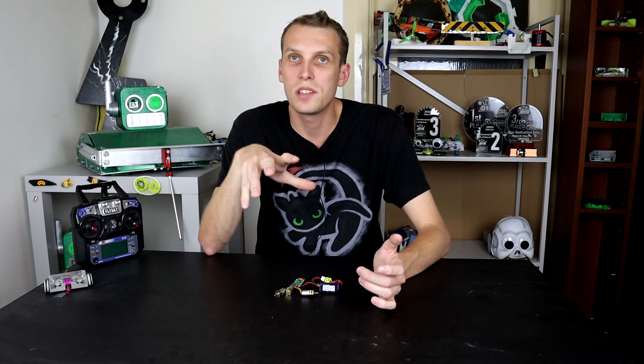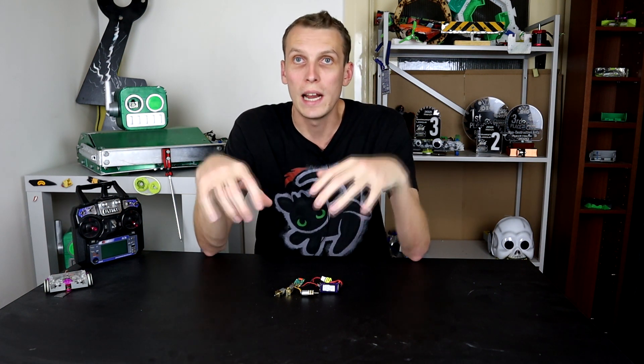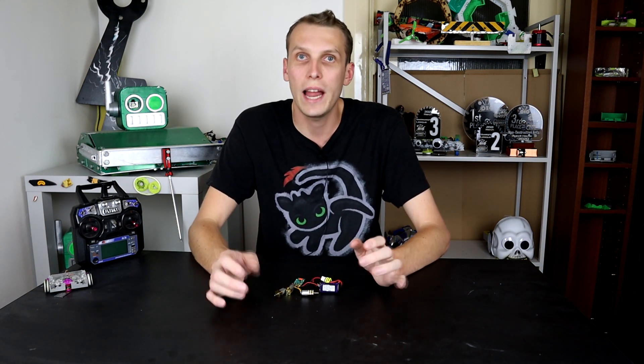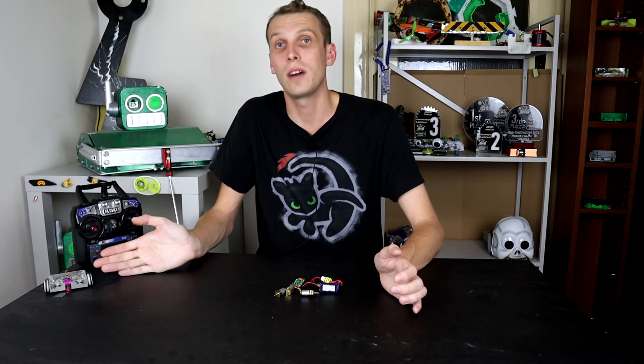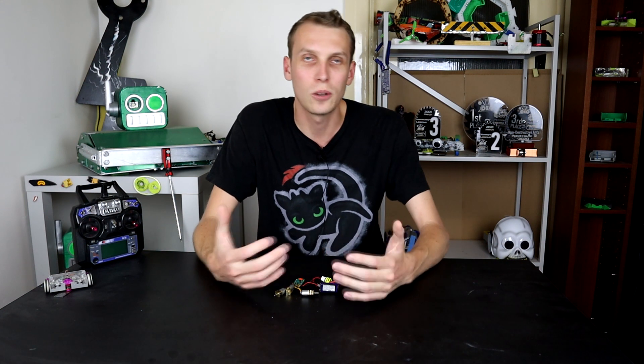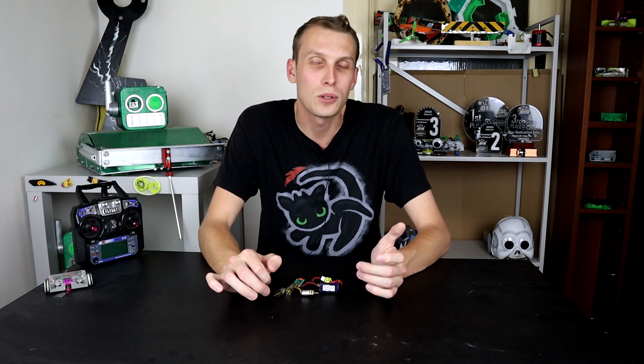Its outputs are where it gets interesting. Most receiver types usually just give you four to six PWM outputs that you can plug into an ESC or a servo. The Malinky ESC, however — well it's in the name — also has three inbuilt brushed ESCs capable of handling 1.8 amps per channel, which is plenty for any N20, N10, or N30 motor. That's basically what you'll be using in a 150 gram ant weight or a 75 gram flea weight, and possibly also American ant weights. It gives you that 1.8 amps at 1s or 2s battery voltage, which is quite handy. It doesn't do 3s, but realistically in these weight classes 3s is a bit overkill anyway.